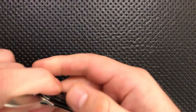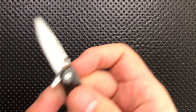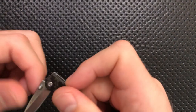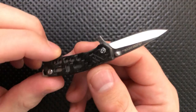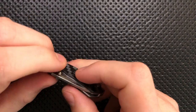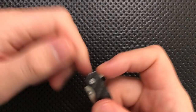On the ugly side, there are a couple of ugly issues. First off, the detent just isn't quite hard enough — it needs some wrist, and that's kind of hard to give in a knife this small. I can get it to deploy reliably by putting a lot of force into it with my arm, but it doesn't work super well with a normal flip, even trying everything I can to preload it — we only get to about halfway. Maybe I could adjust it and tune everything, but the problem is unfortunately this has free-spinning screws and it's threadlocked shut. And given that they're using a proprietary fastener on the other side, it was impossible for me to get in there and tune this at all. I did my best to lubricate it, but it's just not working. So unfortunately, in terms of a flipper, this isn't a great flipper, and that's kind of disappointing.